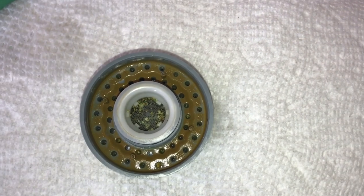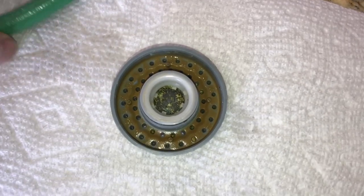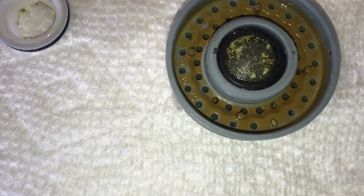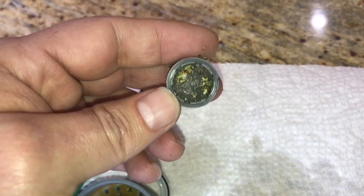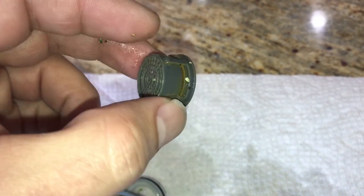At one point in the life of this spray head you are likely going to need to clean up the aerator. See how it's all filled with buildup from the water. Once you've removed the cover, the aerator is right here. You just use a needle nose pliers to remove this piece if it's stuck. Pull it out — it's got another o-ring in here which you can easily pull out. Now you have the aerator. You can just push from the back — this is your aerator. It needs to be cleaned periodically. If you put it in a vinegar and water bath overnight, a lot of this scaling will go away. If not, you're going to have to replace this whole piece.